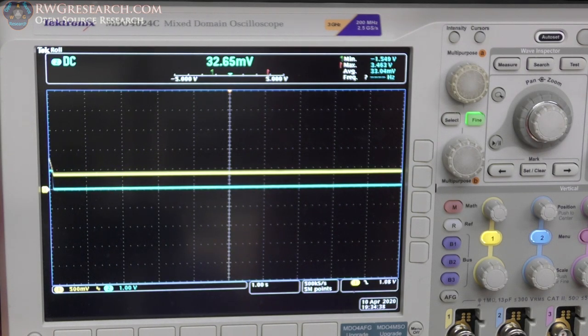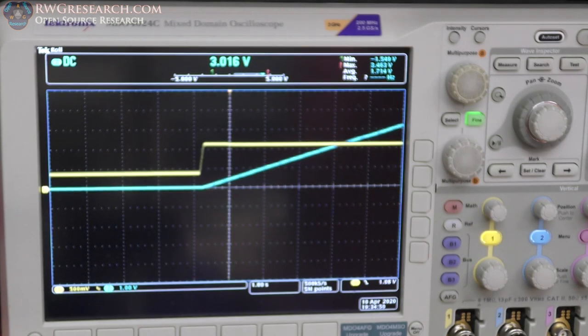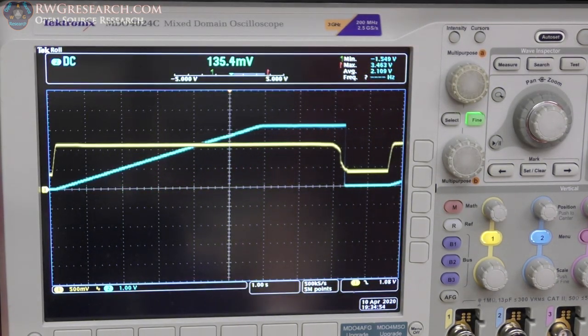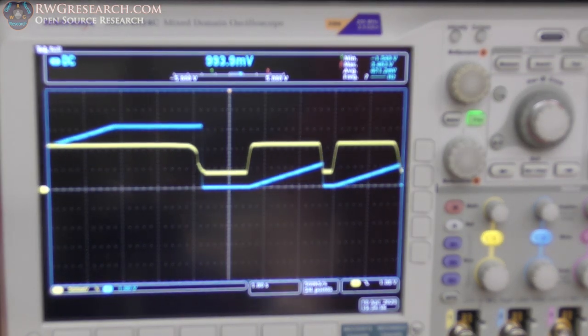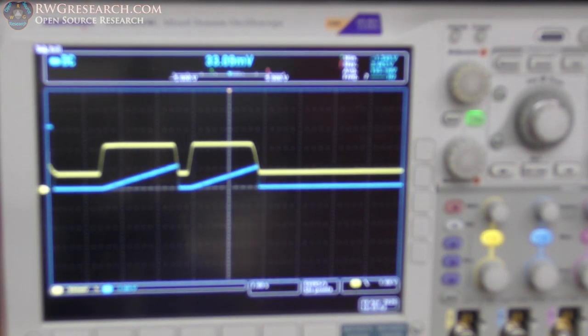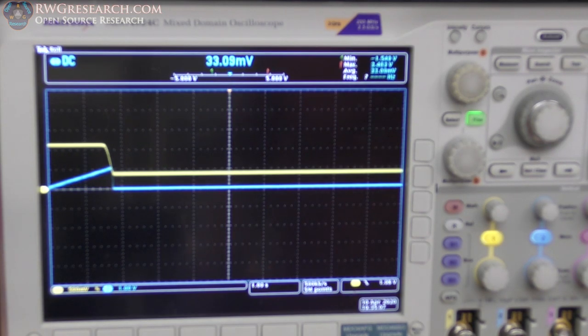So, it seems to work pretty well. I'm gonna go to efficiency not full mode and just see what happens here. So this is efficiency not full mode. And let's see where it actually stops at. I have to calibrate this still. Yeah, so it's still maxing out because I need to calibrate the actual op amp circuit to what I'm really wanting to see on the output. So there's some adjustments to be made there on my side on the programming, but yeah, that's cool. It does actually work. So let me show you the program real quick.